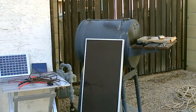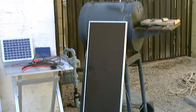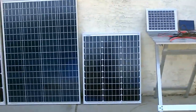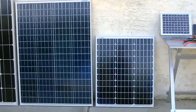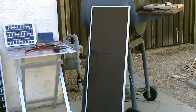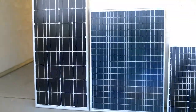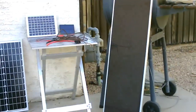So it's kind of cool - if you want to get say 5 watts from an amorphous panel, just take a towel, lay it over it, and cover two-thirds of it. It's very proportional like that. With mono and poly panels, if you cover one cell it wrecks the whole panel output. But as far as a cloudy day - if it's an evenly overcast day with high indirect light - these work okay. They're proportional in that way, but all cells have to be getting the same amount of sun, even if it's just a little bit.